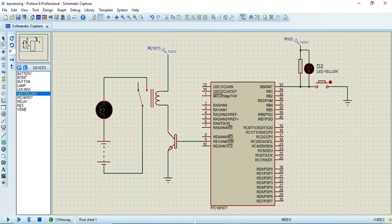In this video we'll see how to detect a key press and activate a relay using the interrupt technique. This key is connected to pin RB0 of the PIC16F877 microcontroller, which is also the external interrupt pin. Whenever this key is pressed, an interrupt will be generated, and using that interrupt we are going to activate this relay. The program for activating the relay will be written in the interrupt service routine.